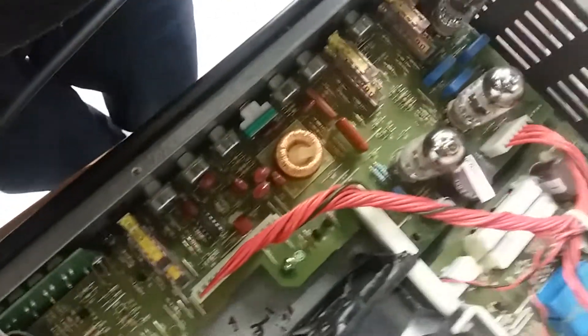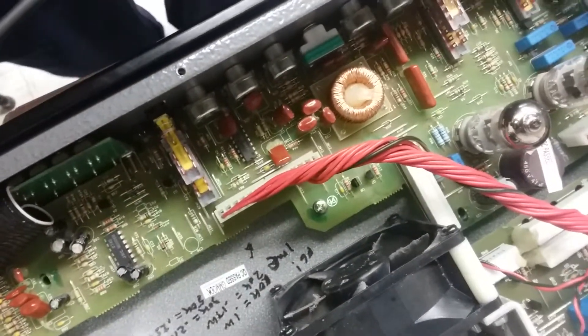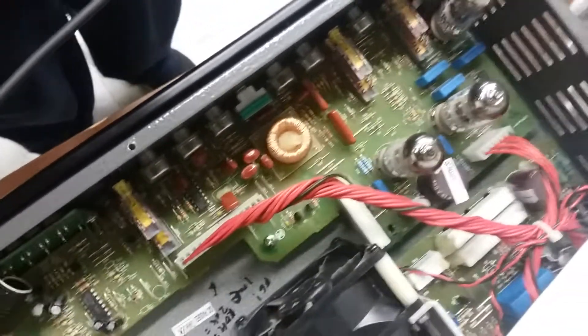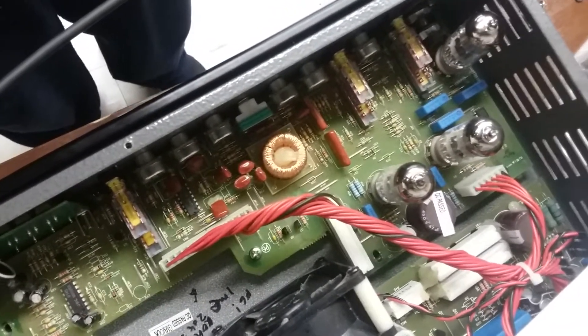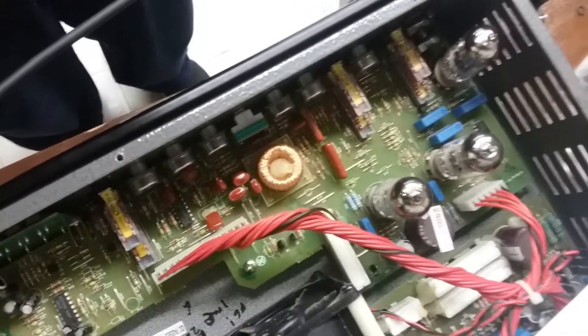We had some interconnect pins that were bad. On that interconnect, pin 4 in particular — I think it was causing the issue. I measured that it was not getting to the dirty ground through the pot; I was getting high impedance there, above 1 meg. Now it's all 850K and on down.